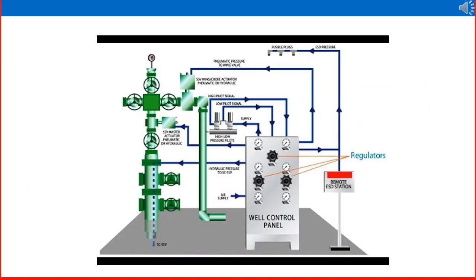Looking at the well control panel assembly: the wellhead is connected to an automatic shutdown system, and readings such as wellhead pressure, flow line pressure, flow line temperature, subsurface pressure, and casing head pressure can all be read from the nearest panel. In case of emergency, an operator can perform a manual shutdown near the wellhead, or a remote shutdown in case of any abnormality such as low pressure, high pressure, high temperature, low temperature, or any leak. Each well has this type of panel installed; some operate on electronic systems and some on pneumatic systems.